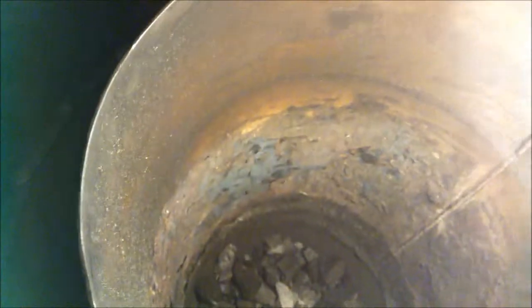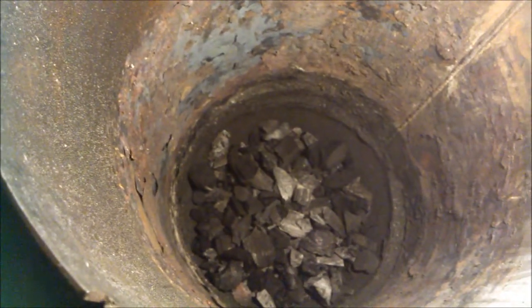Okay folks, here I am again. There is a load of charcoal in the gasifier. I have the Bunsen burner flare ready. The blower is on and I have something like 30 millibar on the pressure. Temperature is zero at the output.